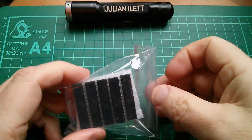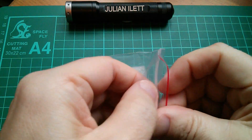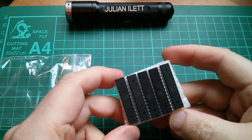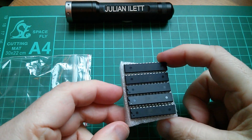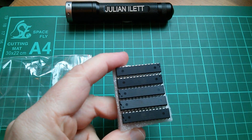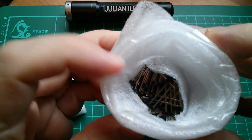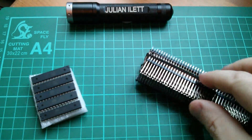Now also, I bought five of these ATmega328P chips, but this time they weren't advertised as having a bootloader, and I'm kind of hoping that these don't have the bootloader, because I then want to do another video — after the build your own Arduino video — on how to install your own bootloader. And for that, we're also going to need these. I'll just open these up.